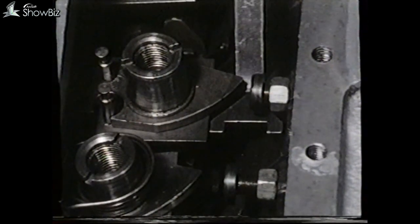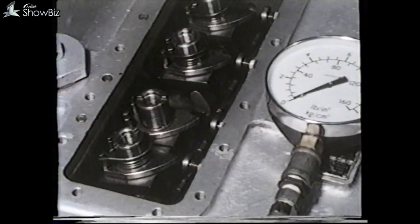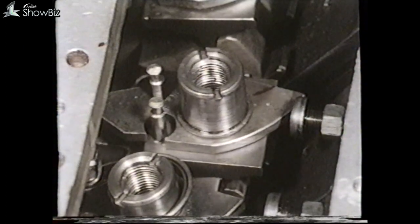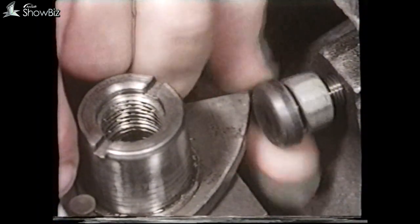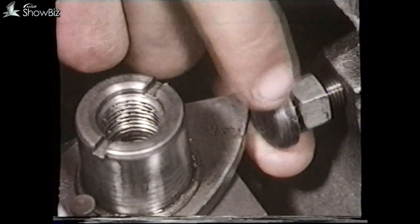In this instance the gap is too wide. Therefore release the gear and turn the adjuster nut only slightly in an anti-clockwise direction. This will allow the table to come closer to the brake band on the next application. Now check the gap once more. When the gauge just supports itself between the adjuster table and the brake band, the setting is correct. With the gear applied, it is now time to bring the striker screw back until it slightly deflects the striker plate, like this, and tighten down the lock nut of the striker screw.